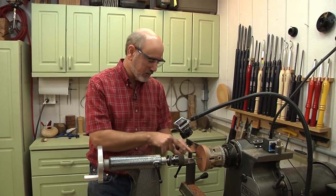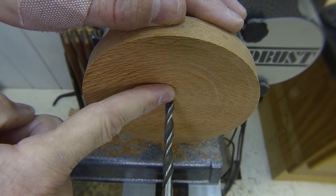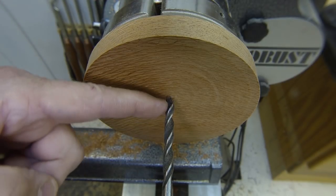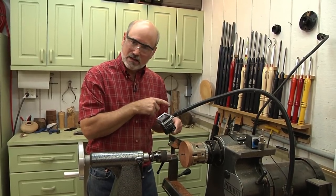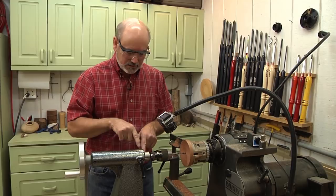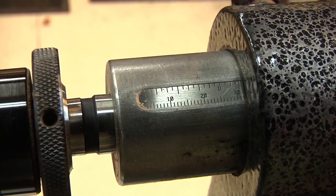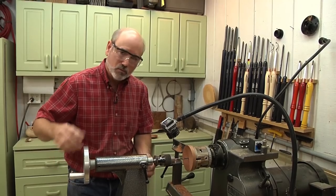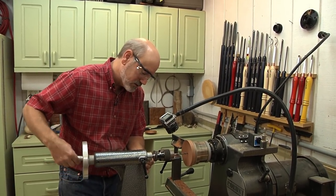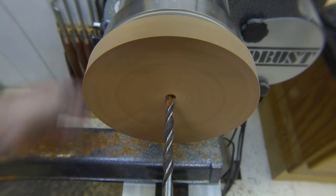I have my Jacob's Chuck set up with the quarter-inch drill bit — it's actually touching the wood right now. I know the depth inside where I cut goes to about where my thumb is, and I can drill to about there. This drill bit is a brad point bit so it's got a point on the end — factor that into your measurement. The way you can be accurate about this: on the Robust American Beauty, it has an indexer on the tailstock — basically a ruler inside of it. So when I move this back and forth, you can see the numbers change and I know when I've reached whatever depth I want. I park this with the tip touching the wood, turn it on, and slowly advance it one quarter of an inch.